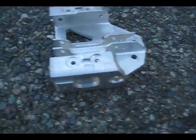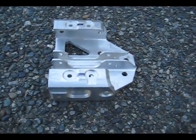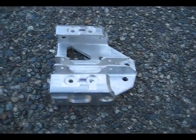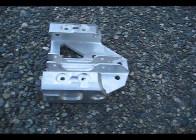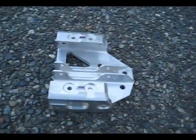This part here was made out of steel — this is an aluminum setup part. It was made out of 4340 hardened steel, if I remember right. We roughed it out and left excess prior to heat treat, and then finished after heat treat. It was done on a four-axis machine.